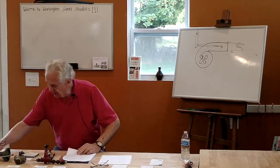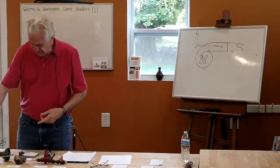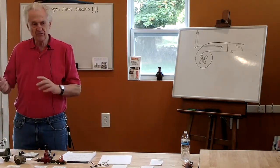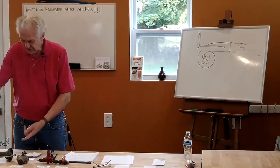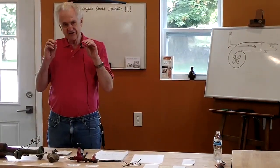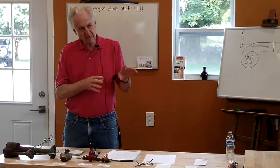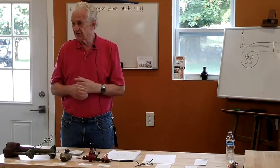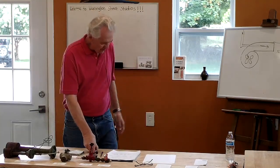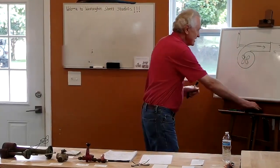As I say, the example I have up here is a Venturi burner, and this Venturi is an old principle, also called the Bernoulli principle. It was a scientist who discovered that when you study gases, if you cause a gas to go through a constriction, it speeds up, and when it does, it actually creates local low pressure. This is the same principle that made the carburetor work in a car.